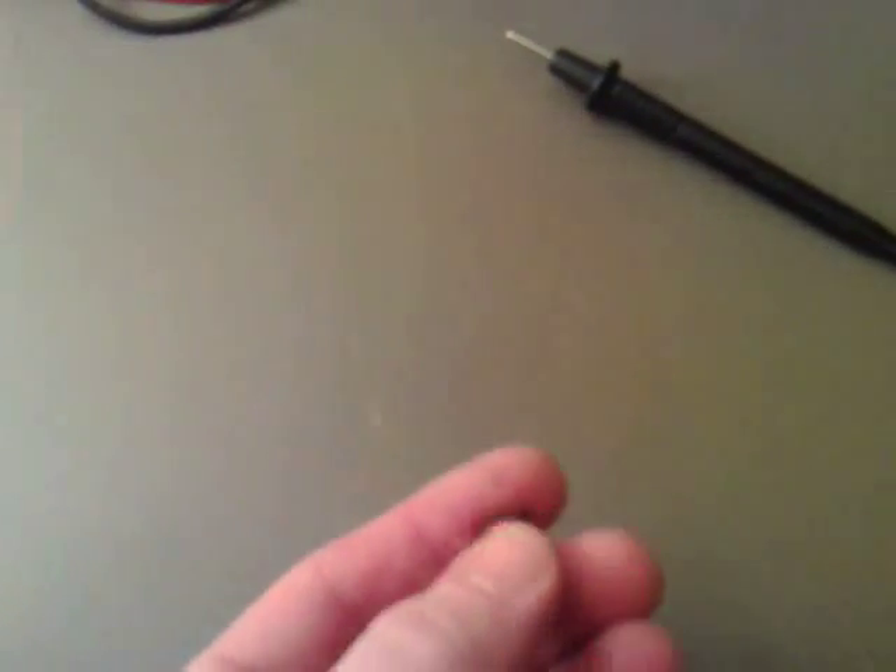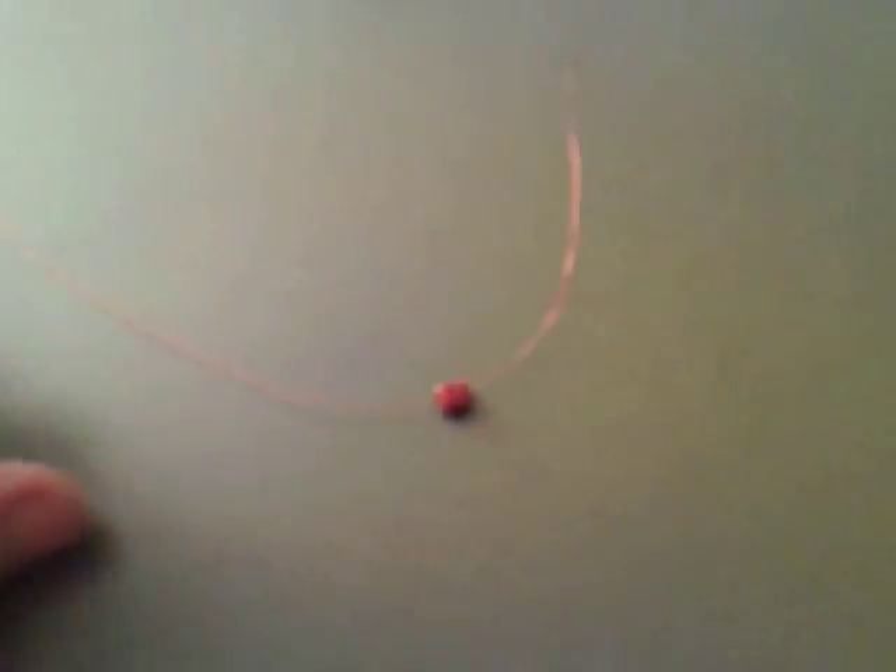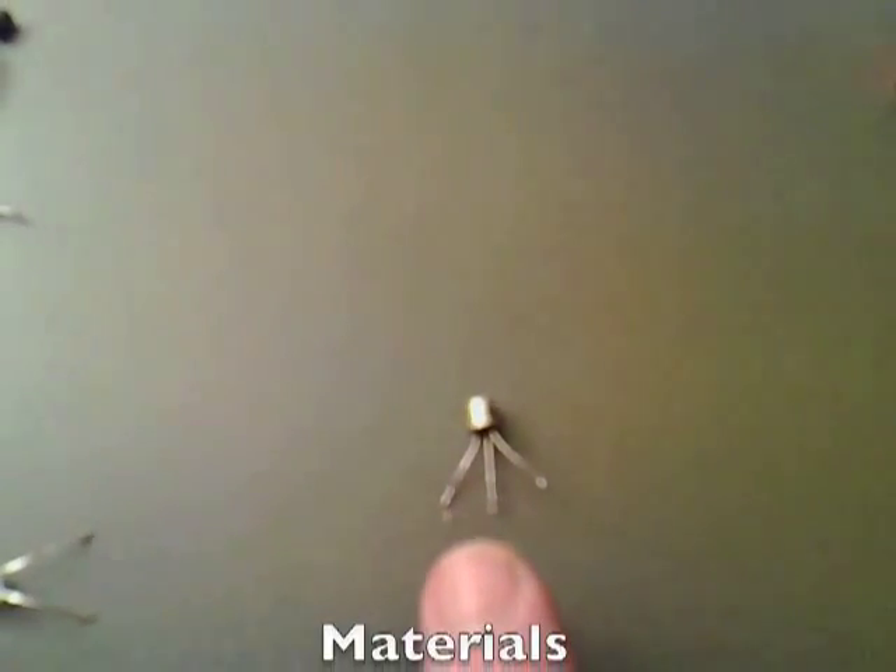I've salvaged some two-strand wire out of an old electrical component. Get about a metre of that, put it through a needle, and just keep threading it round until you get one that looks a bit like this. I think I've got 50 coils on this one, so you can see that you can't see any of the ferrite. All you have to do then is strip back either side with a nice sharp knife and then solder or tin the ends ready to put onto the 2N2222 transistor.